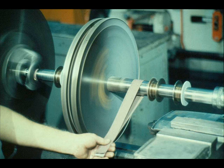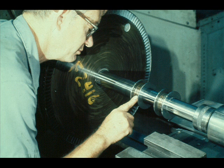You must be very careful, though, not to remove too much metal during the polishing, since the tolerances must not be changed. After you have completed an inspection of the shaft, take a close look at the seal sleeves to be sure they are not damaged. If they are, it is a good indication that you have a problem with your bearings.